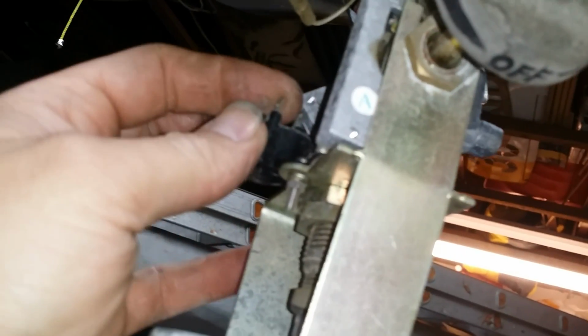Now, what happens, this thermocouple up here, when it gets hot and the fire's lighting on it, it actually produces a tiny bit of electricity, okay? So that electricity comes through into this tip switch, and there's a little ball that rolls around in there. If that tip switch is good, and it's right where it's supposed to be, and it's not tipped over, it will send power through. You get connectivity through here, okay? Which will send power into the back of this valve over to here, okay?